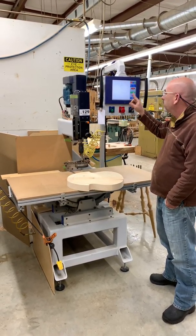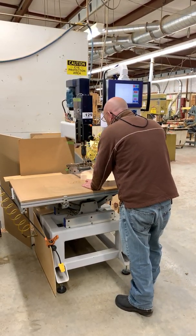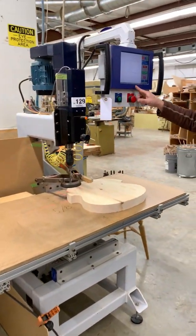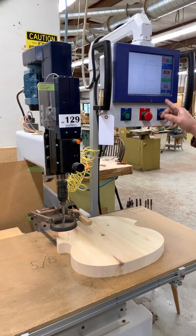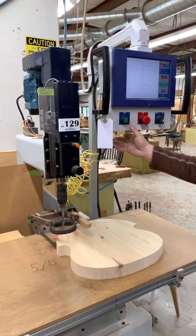So we're going to drill this first hole in a series of spindles. We have a half-inch drill. All you do is orient the chair as it shows on the screen. It does take a little bit of setup, but once it's done, it's not too hard. And then it's as simple as — it's going to drill this first hole at 9 degrees to the left and 14 degrees to the back.